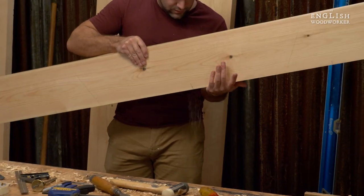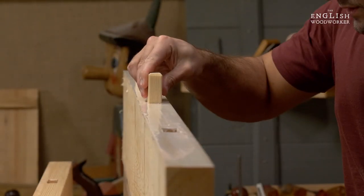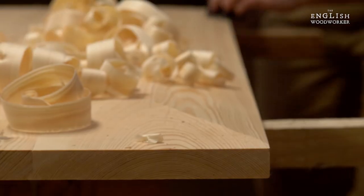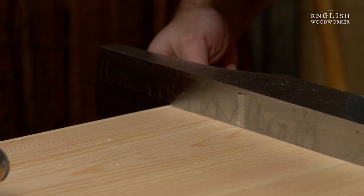The top is about 32 inch wide and a bit under seven foot long. Each of the boards are mortised and tenoned into each other so it ain't going nowhere. It's a heavy thing as it's a full two inch thick, but I taper it down at the edges to lighten the look. It's then capped off with some simple end caps.